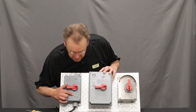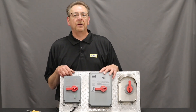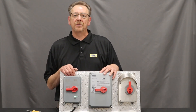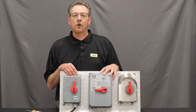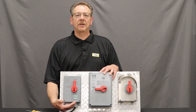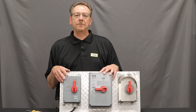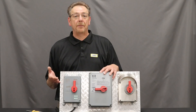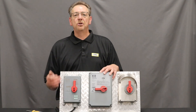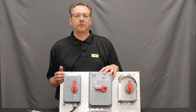What we do is demonstrate diagnostic capability. We see that there are three lights lit, showing that power is coming in on the line side. When we energize the switch, you'll note that there are six lights lit, showing that power is now going through on the load side. This is great so that an operator can see that power is already at the disconnect and it's flowing. In the event that you have a dropped phase or a crossed phase, you would lose those indicator lights.